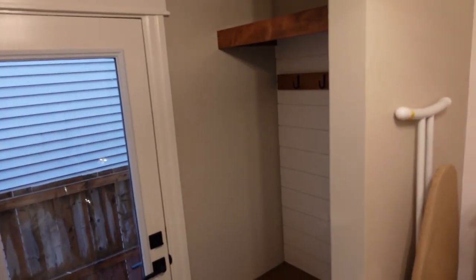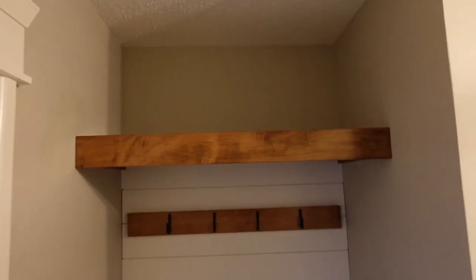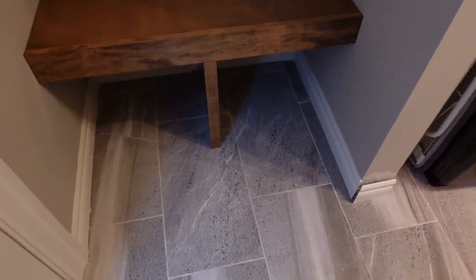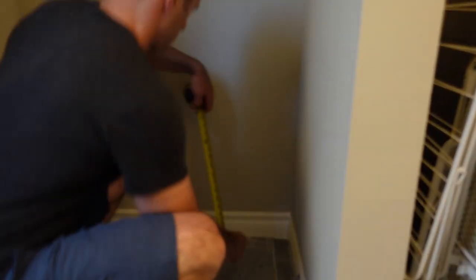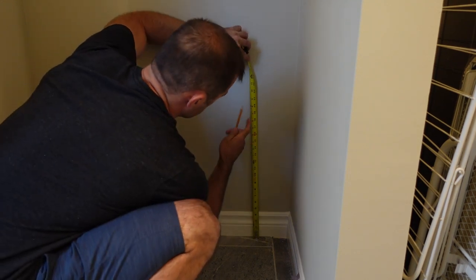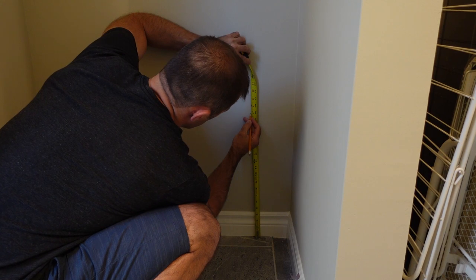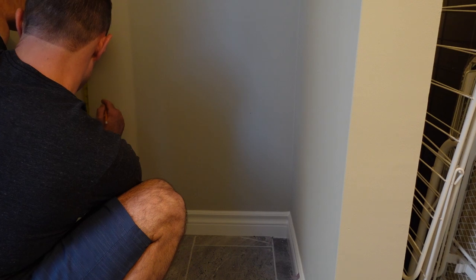In this video I'm going to show you how I put together this mudroom shelf, hanger, shiplap and bench combination. The bench has two compartments where I'm going to slide some bins. It is a bit of a longer video, but I'll try and make it as short as possible. The first thing I'm doing is marking out where I want the top of the bench — I'm putting it at about 18 inches, based on an existing bench in the house.